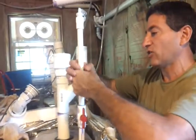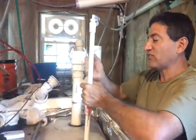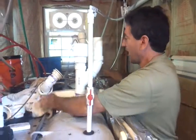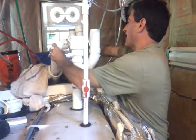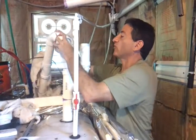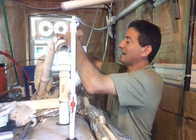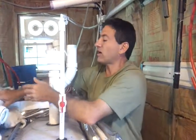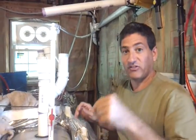Have it be so that at any point you can also take this off and jam a stick down here. Here we do have a union, as you can see, and that union is what made it easy to unscrew so that we could get inside here with a pole. Having unscrewable unions everywhere will cost you a bit more, but it'll certainly save you a lot of trouble.